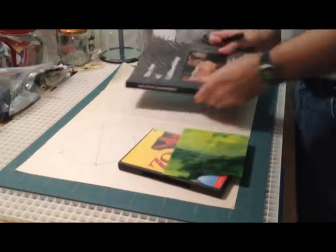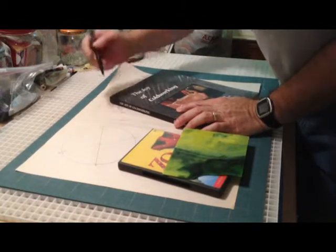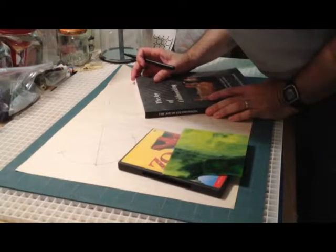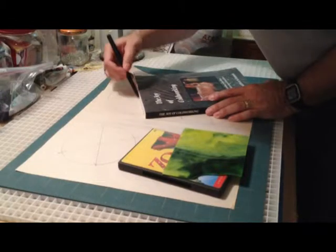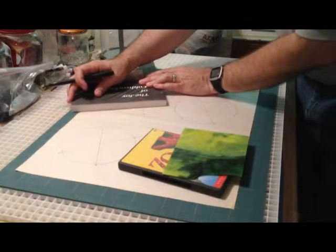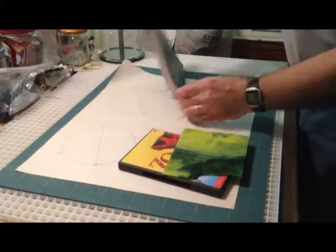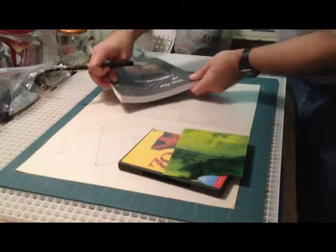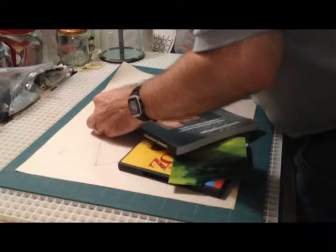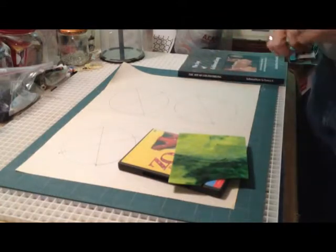You can do the same thing with a book — all right angles. Line it up so that the right angle is touching the circle, intersect the line, then just do it one more time. And that's how you find the center of a circle.